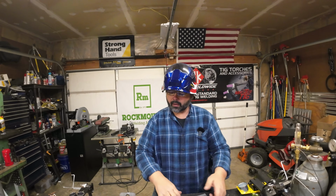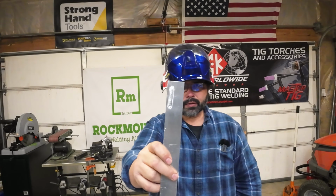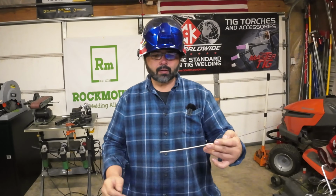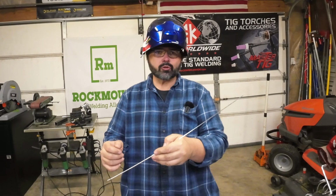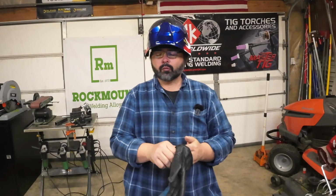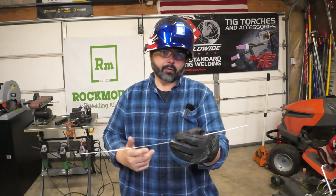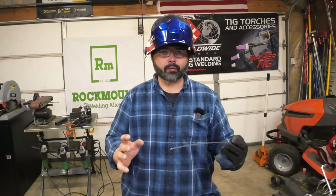assuming you're not using a button. And while I don't claim to be the greatest welder in the world, you're trying to get your dabs somewhat consistent so that you can control it. And it's a lot to do, especially when you're trying to feed. If you've got a long run, a lot of people will just hold it and just keep slowly pushing it in. But if you have a long feed you have to do, there's several ways you can feed the wire where you're just pushing. I've seen, I'm going to call it the inchworm, if you will. But that's difficult when you're trying to figure out everything else.